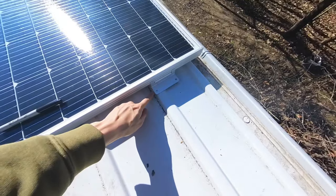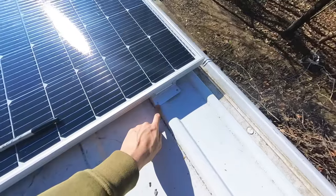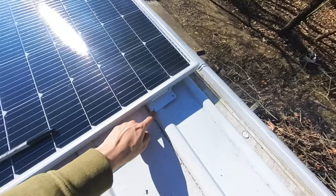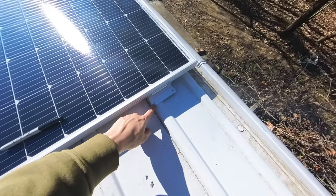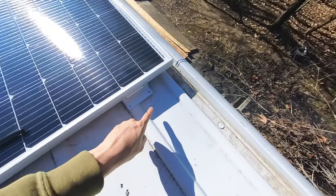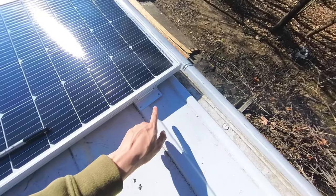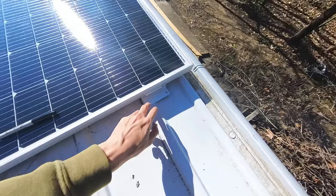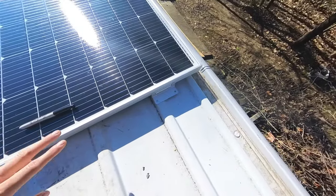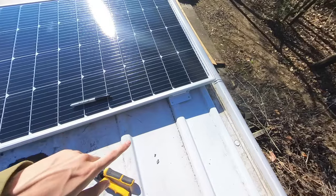As far as the planning goes for how I'm going to install it — there's a hole right here on this ridge with a gap underneath. I'm only going to be installing these at the four corners. The thought process is: when I drill a hole, the water will naturally run off from these ridges and go into the channels. I didn't want to risk drilling a hole and adding supports that still leak. It makes more sense to put screws at the four corners, and these panels don't weigh much, so I'm confident four screws will hold them. I'll be marking the holes, drilling them, installing it, and then putting on the lap sealant.